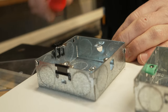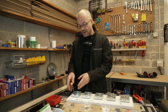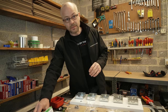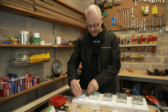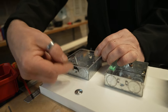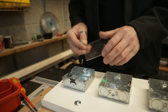One thing with these - because I've used them in the past - is that sometimes the back box is so close to the wall that the filler around the edge means you might have to take a small knife or screwdriver and just scrape a little bit of that wall out of the way first to allow the clip to go in. But it's not an issue because the accessory will always hide that damage. Taking the cover again, you can see just how simple that is - gone straight in there without any problems whatsoever, and even with it being bent very slightly it doesn't really matter too much because the back box is fairly flexible and will always pull into a level positioning.